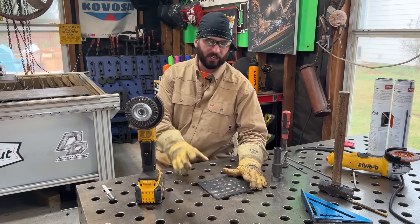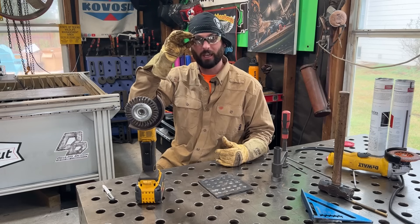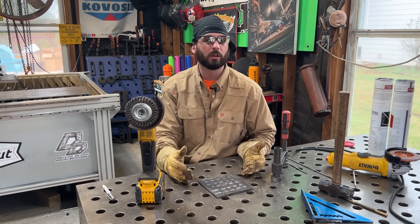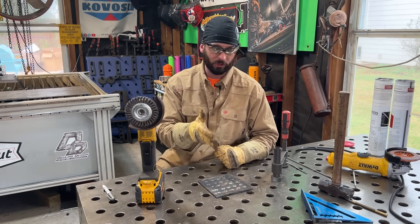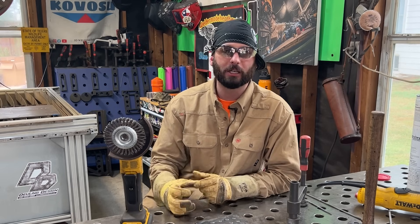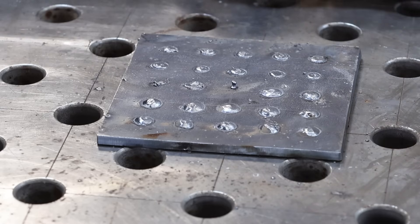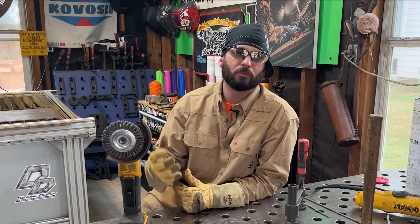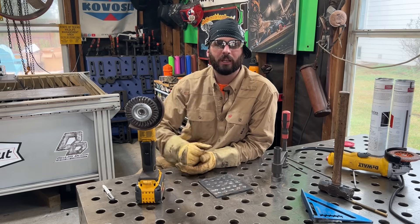The whole point of this exercise is to get your fundamentals together. You've got to have those fundamentals before you can strike up and get the fundamentals of running a straight bead. If you haven't seen it already, we've got a great video on how to run a straight bead right after this. The whole point of the grid is to have the right aim - you're supposed to be doing it in a specific spot, so make sure you have a specific spot to aim for. Try to be consistent with the same size nugget you're leaving down, because that's the same size as the rest of the weld as you progress from making dots to making straight welds. Be sure to check out the links in the description from our partners like Ariat and ESAB. We'll see you guys on the next weld.